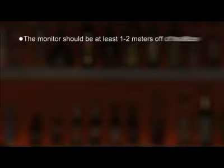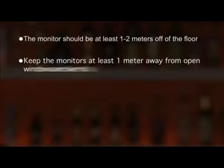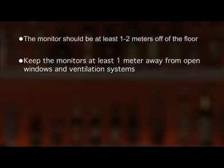There are some key things to remember when looking for a good place to hang the monitor. The monitor should be at least one to two meters off the floor. Often the best places are near the ceiling, so as to avoid people tampering with them because they're out of reach. Keep the monitors at least one meter away from open windows and ventilation systems, including fans. While this may not be possible given some warmer climates, it should be well documented on the field worksheet the proximity to windows or fans. It is often advisable to document the presence of any windows, fans, or ventilation systems so that during analysis the lab can better understand the environment where the sample was collected. Knowing this information can help determine the air exchange or flow rate of that particular room.